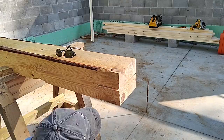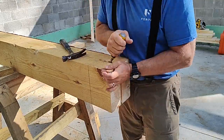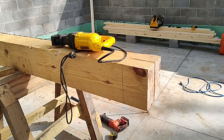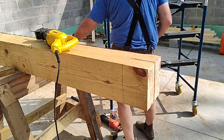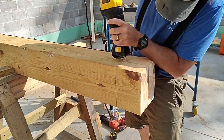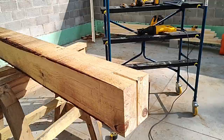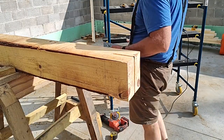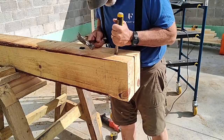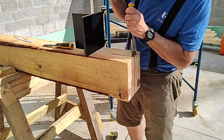I've already gone through the end of the timber with a skill saw to take out a lot of the material, but this is a quarter-inch slot that's eight inches deep so it's a little hard to get to. I brought out a set of chisels and also my electric sawzall — which meant firing up the generator — but it chewed through the excess wood more easily. This really boils down to not having the right tool on the job site. The smallest chisel I had was a half-inch and I didn't want to make the hole that wide, so I did some rough hollowing out and came back with the chisels to clean it up, and you can see I've got a pretty good fit for the knife plate.